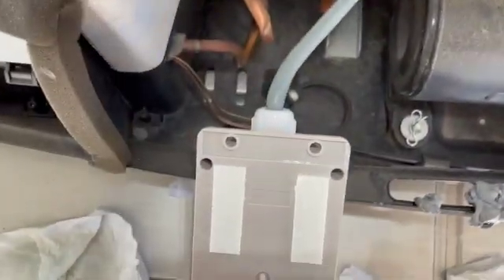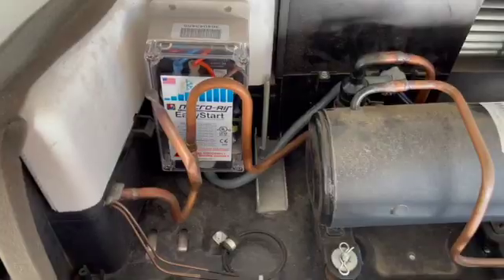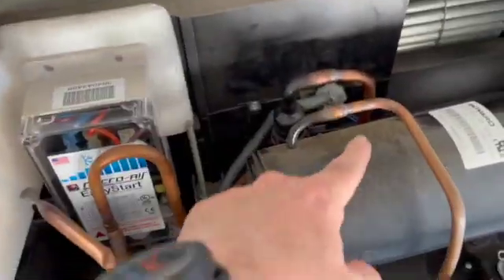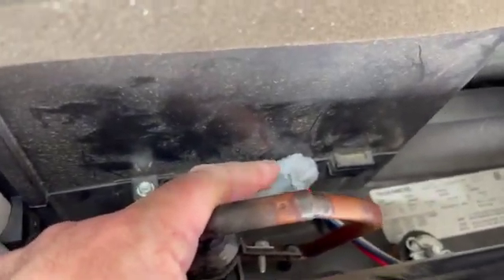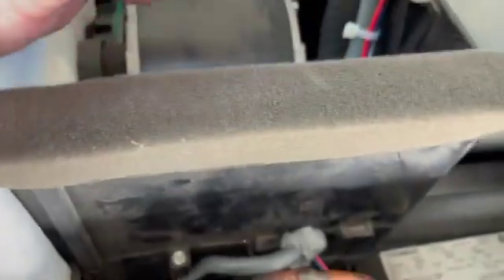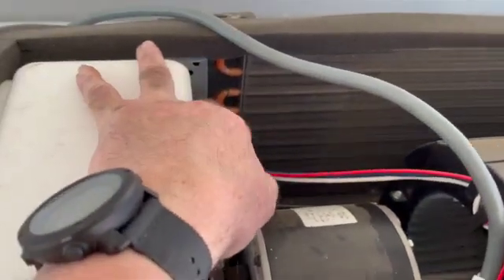The goop is off, so we've got a place to put the wires. I'll clean this up with double-sided tape, then take the MicroAir EasyStart and stuff it in there and attach it to the plastic. The MicroAir is in. The cable going through this plastic piece — I centered both pieces of wire and surrounded it with sticky sealer to keep it away from the plastic and prevent chafing on both sides. Zip tied it. Next, we'll open up the electrical box, feed this cable in, and start making connections.